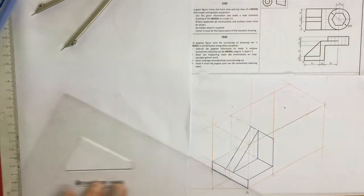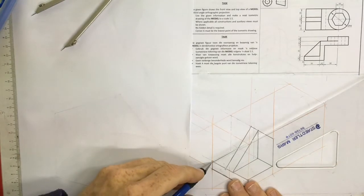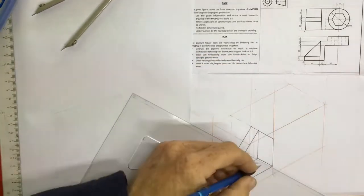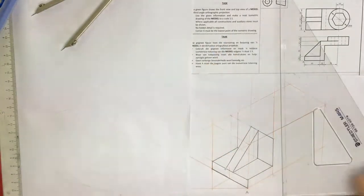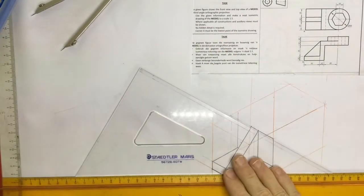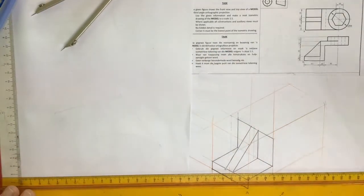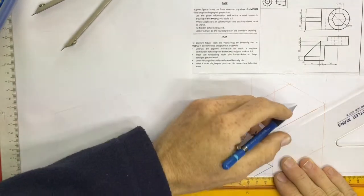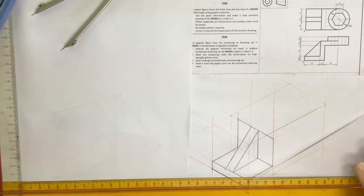All right, going to carry on over here. You're going to draw a construction line over here, coming out, actually a dark line coming out. You can link it up with that little bit of construction line over there, coming across from this line. And you can then take a line coming up over here, construction line coming up over here, and you'll be able to draw in this story over there and drop that down over there. Right, once I've got that in place, I can then draw a line coming across. I think what I'm going to do is I'm going to try and find those circles at the back here first, and then we're going to project back in order to try and find everything.